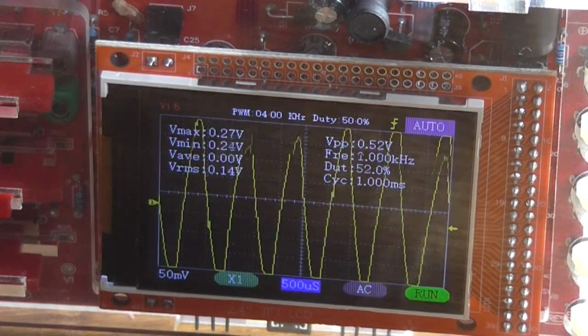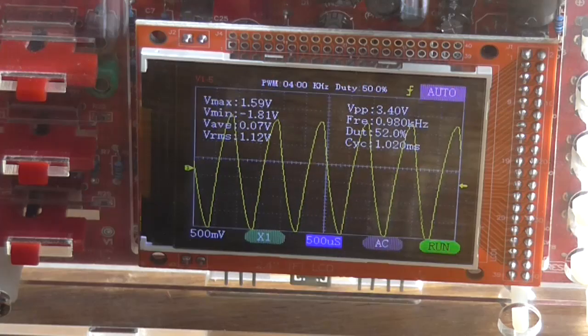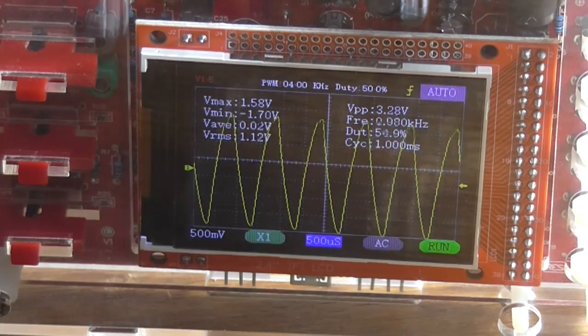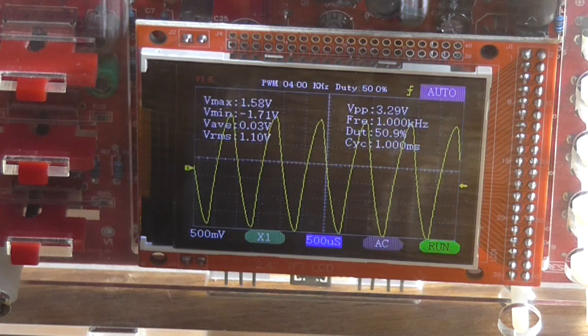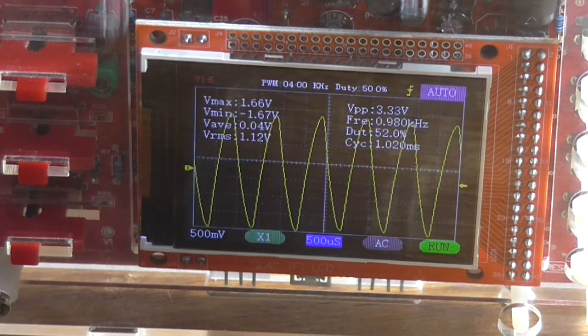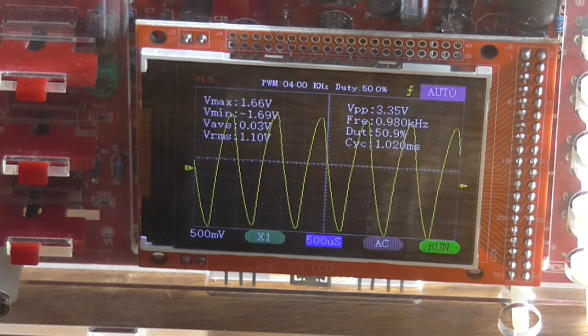We're winding the control up. Whoa. So the actual maximum output voltage swing that I'm getting is around about 3.4 volts peak to peak before clipping. That's with the master control wound full up and the gain control about halfway, just before the clipping diodes come into play. And yes, I have soldered them back in. Well, soldered the resistor back in.